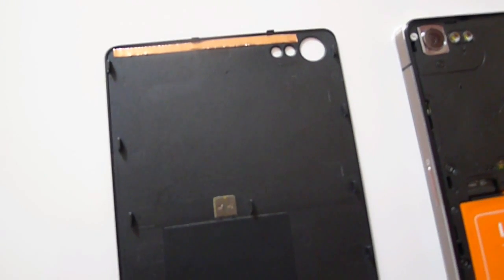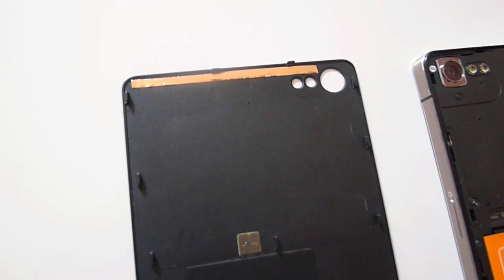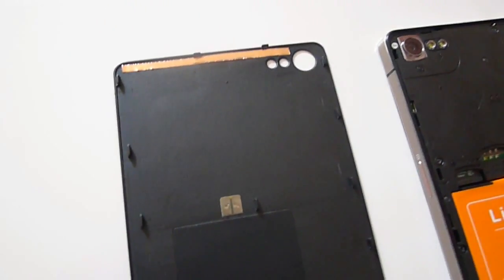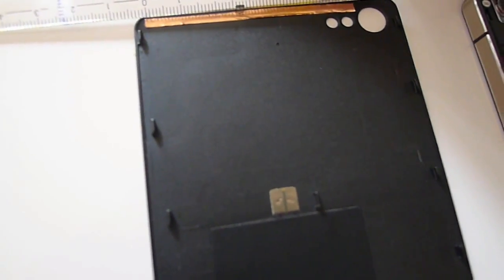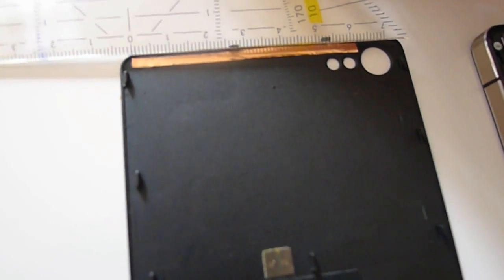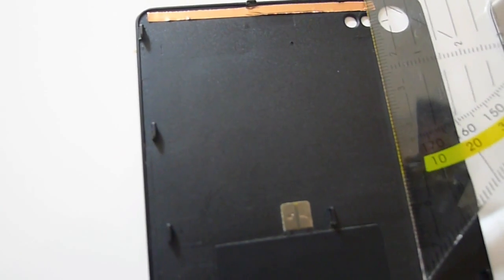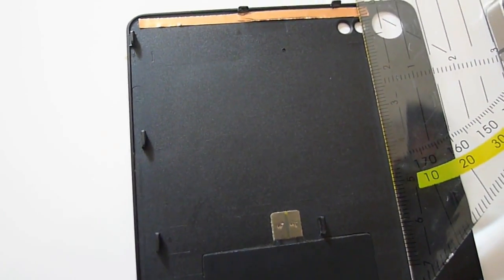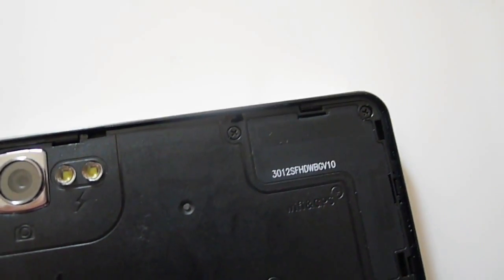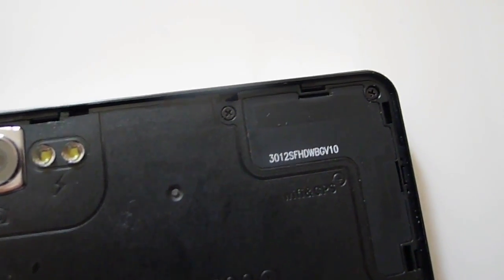I've experimented a little and found that this strip gives the best results. I cut it out of the copper tape and it's about 6.2 centimeters long and 3 millimeters wide, and it just sits above the GPS receiver.